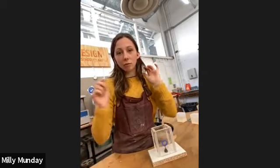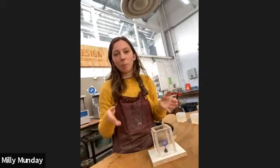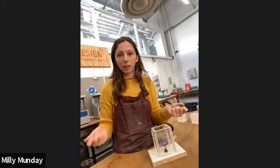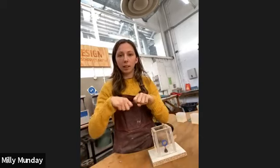Each different type of silicone has different ratios, and it's the ratio that is really important. If you get the ratio a bit wrong, then you're risking the silicone not properly curing and not properly setting, and just remaining sticky, surrounding your model with a sticky mess. So you would take the time in your measuring of it, weighing it out in two separate containers, your part A, part B, get their weights right, then combine it, thoroughly mix it together.